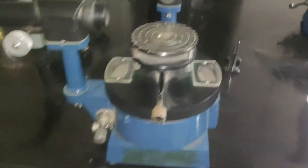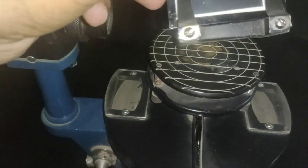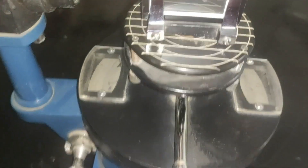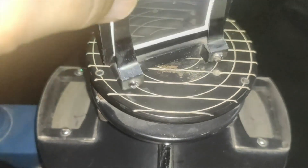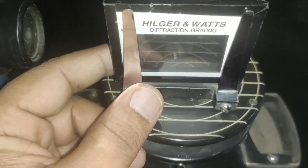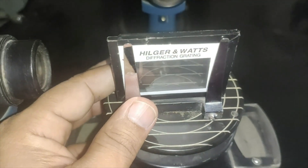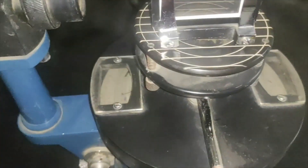Next, I have to put this grating with the unruled side facing this direction — perpendicular to the collimator. Try to put it perpendicular to the collimator like this.